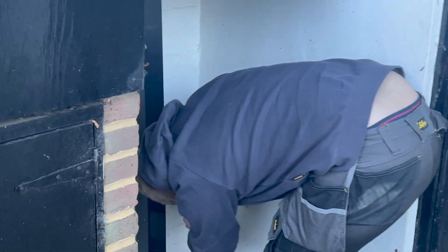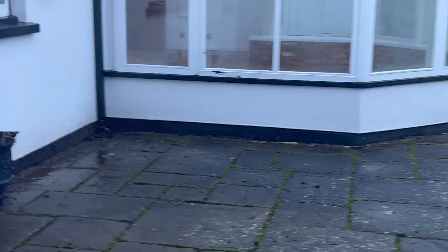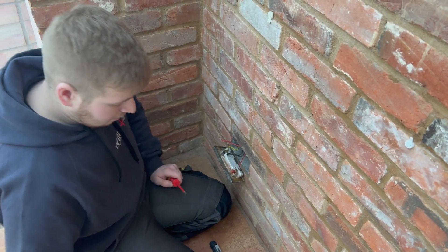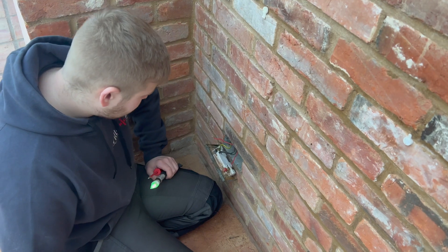That's off, that's off — that's going to be the same circuit but well protected. We've only got one door we can get in, people haven't moved in yet. What Ollie's doing is splitting the ring. We looked outside — what we thought was a black socket is actually a plug top, which is unplugged. So it covers the utility and this conservatory. We've split it where it looks the roughest.